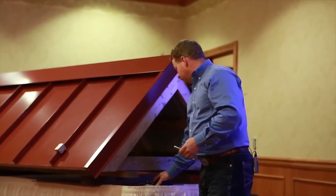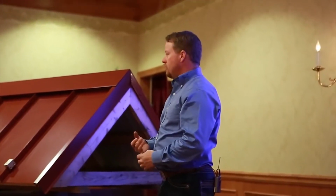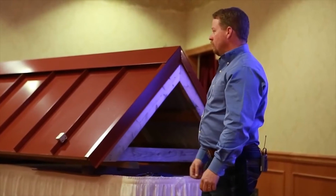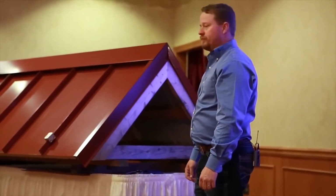The Panasonic is definitely not a requirement, but it does make life easier. It'll help you install products faster because you're not feathering it and trying to figure out how tight it should be. You're just holding the trigger all the way through. It does result in tightening down a clamp much faster.